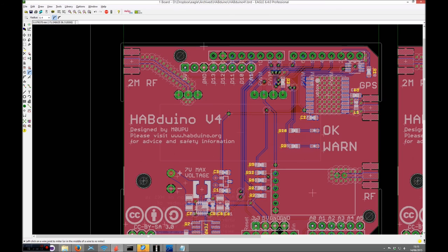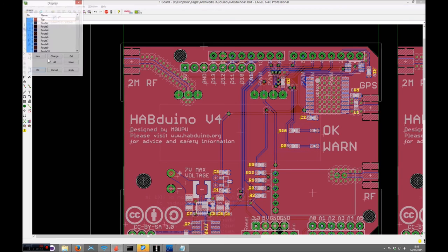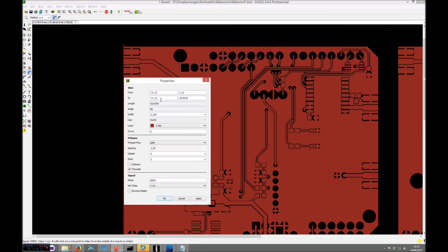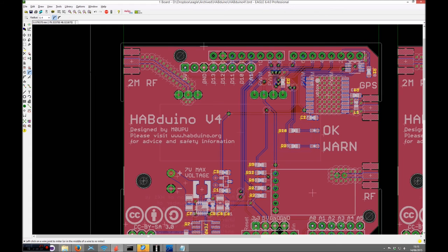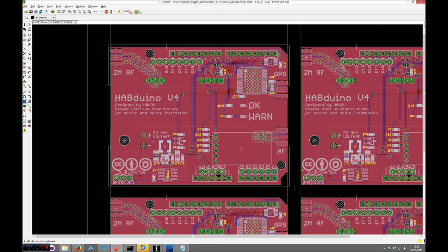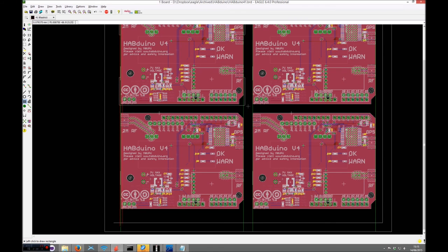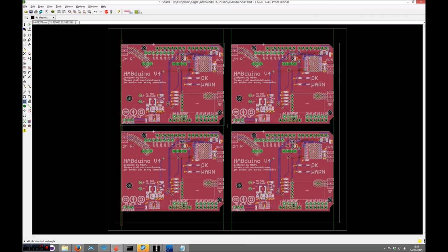One other bit of advice, if you turn all the layers on, you're going to get now a big cutting disc chopping all the way down here, and you've got a copper pour right up to the very edge of that, which obviously can get torn. The routing bit can actually tear the copper. So to avoid that, what I tend to do is you click on the polygon tool, and then you select the T restrict layer, and you draw a polygon along the actual vscore line like that.